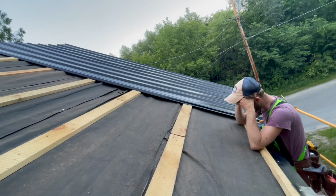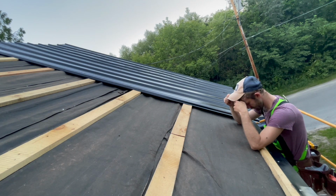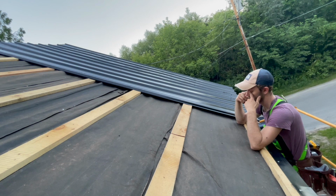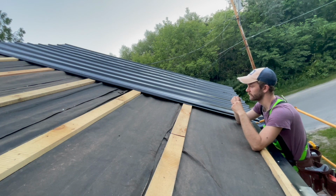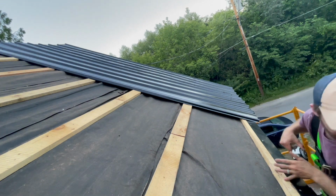Seven eighths over eight is one, with three left over, one eighth. No, yeah, 1/8 plus a little. It's 3/16, not 3/8. 3/16. And I can shift that by both edges, so that's 3/32. I just got half of it right there. Thankfully, I measured out some marks here.